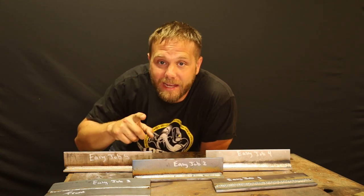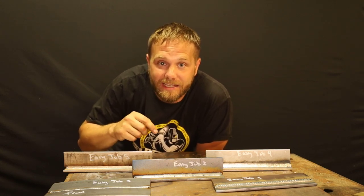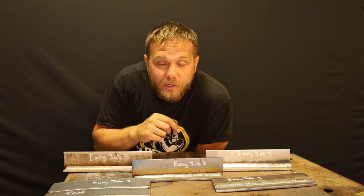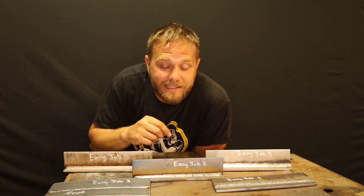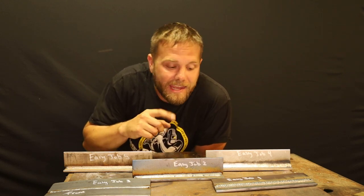Now there's 2 different packages. Package number 1 is a MIG package. Package number 2 is a TIG complete. Both setups come with 030 and 035 drive wheel kits, also 10 contact tips each for both those sizes. Now let's say you want to weld aluminum. I do suggest 3/64 wire, so you're going to want to order 052 contact tips and a 1/16 inner liner. Other than that, you should be ready to go. Now let's take a look at stick and TIG. Let's go.